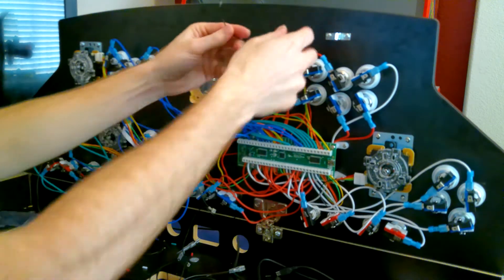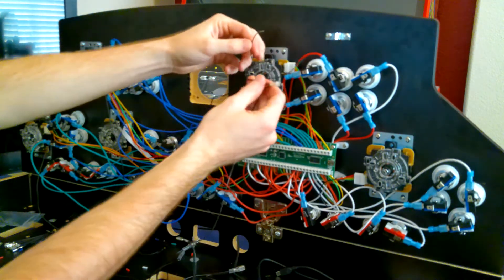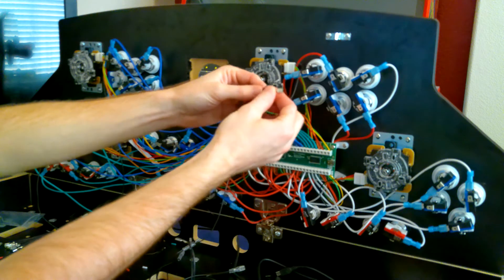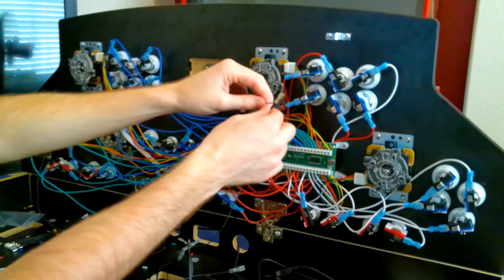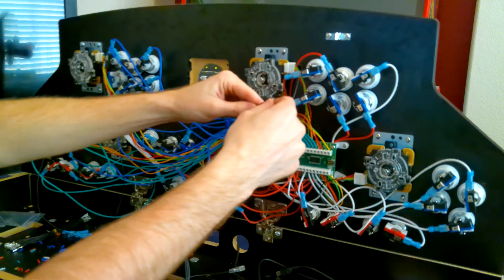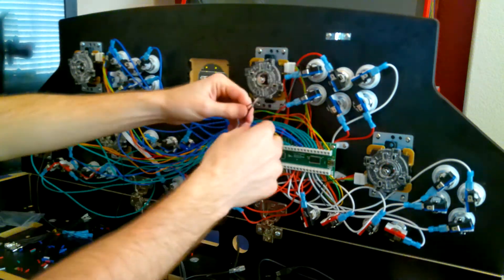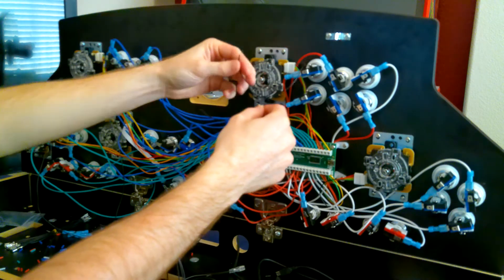As you can see, this wire has a little tip which will not go on this connector. So what we have to do is snip this off — we'll have three wires: the two connected to this and then this one. We'll splice them together, put a little blue cap on it, and the joystick will be grounded. Then we can just continue on with the rest.